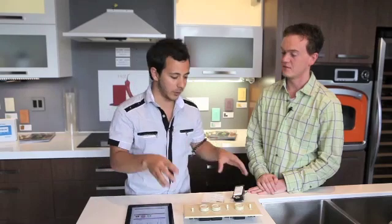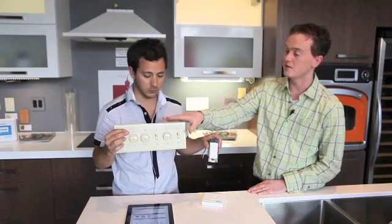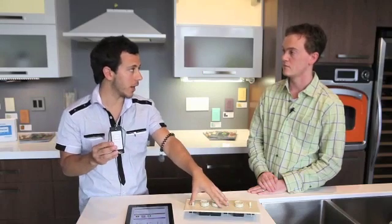Let's talk about new construction and renovations. For new construction, you would literally have a bank — let's say you've got six locations in your home — you would literally hide this somewhere in a closet. What we're really doing is not eliminating these switches; we always need them. But the point is that we're hiding them to some discreet location where the wall acne won't bother us. They bring all the wiring for your lighting to this location, and now wirelessly this would talk to the actual bank of switches and dimmers in there. It's like someone virtually turning these dimmers on simply by pressing this.